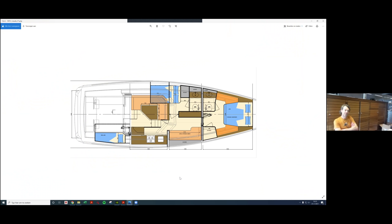Yeah, definitely. This process yields a lot of different ideas when a normal fiberglass boat builder wouldn't be able to make changes like that. Yeah, you could even shift most of the bulkheads inside. Yeah. You want to keep that one under the mast, but most other ones, there's enough strength provided by the aluminium hull that you can shift watertight bulkheads around inside the yacht. Versus a fiberglass boat where you really can barely move bulkheads at all. So it gives so many options for customization.